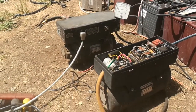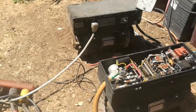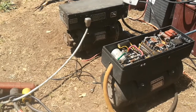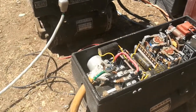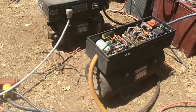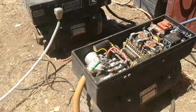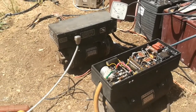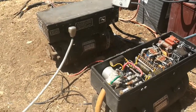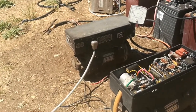These units are much more reliable. They have components on the inside, but the secondary outlets on the side — it says they're for refrigeration — don't have any power output on either unit. There's a solenoid and little AC relay switches that actually turn the converter on, and DC capacitors and other components that all feed to that side outlet, which doesn't seem to have any power output. I can't find any diagrams for these units. The main appliance outlet on the front does work, and that's pretty much where the main power comes from.